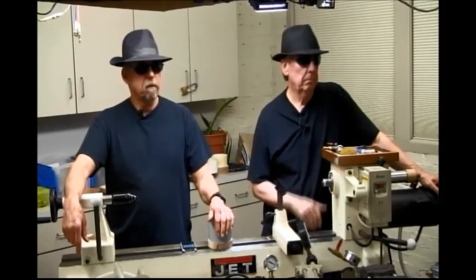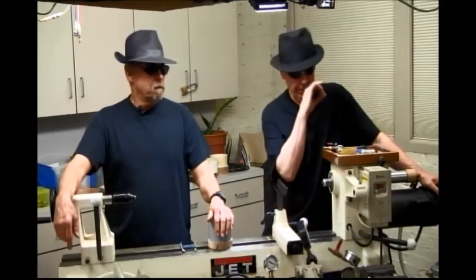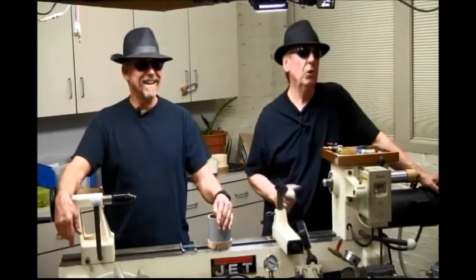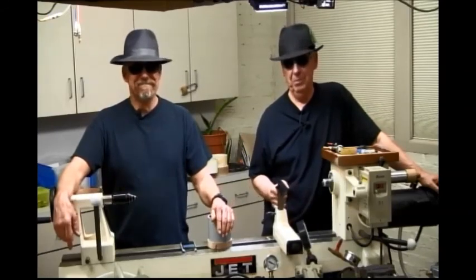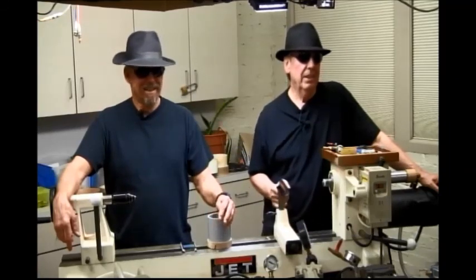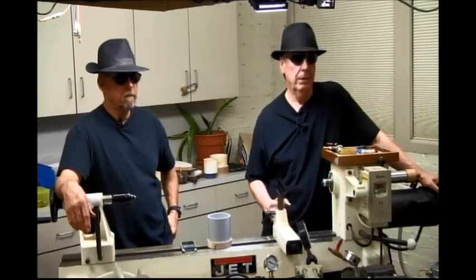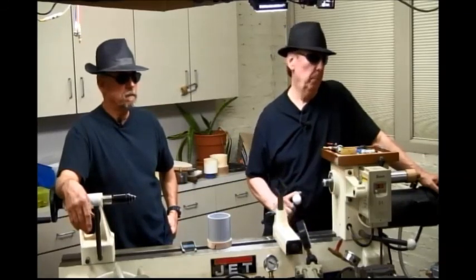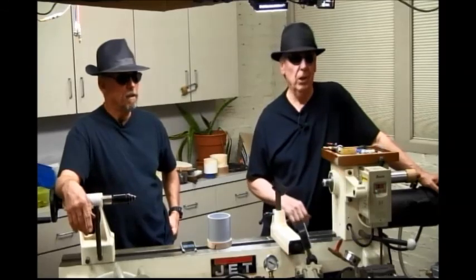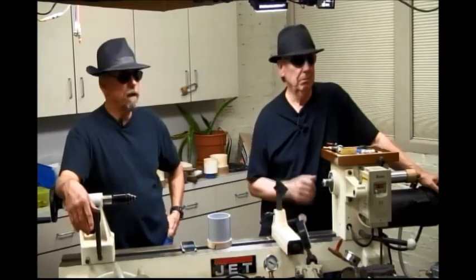Well, what am I shopping for? Just plain sealed bearing? You want a double sealed bearing, and the ones we use that have a half-inch hole are 1621 double sealed. So if you can see the balls in there, that's probably not a good bearing. No. If you can see the balls inside the bearing, don't use them. Purvis here in town is a good source for bearings. They're expensive. I paid $13 or $14 for one, and I'm buying them for right around $5 online. You can get them for a couple of bucks online. Glenn says you can get them at VX Bearing for $2 or $3. But you got to pay shipping. Yeah, plus shipping.